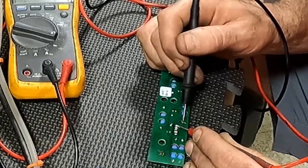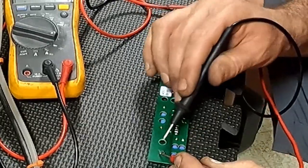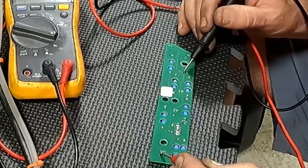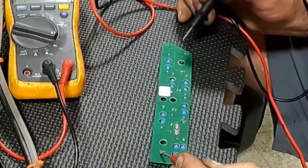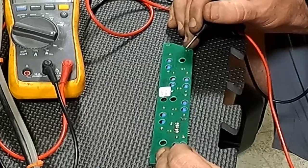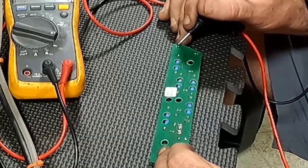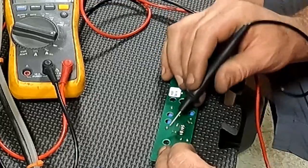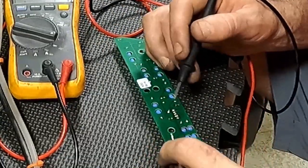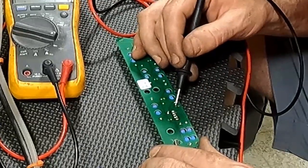You can see that trace goes to that one, so that's good. I'll test continuity from there to there, and test this LED here just across to make sure everything in line has continuity. That one didn't beep — and it's not beeping on the other ones. Part of testing continuity is also making sure you aren't connected where you shouldn't be connected, so no beeps is good as well as beeps being good.